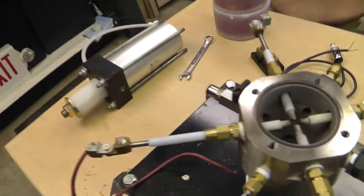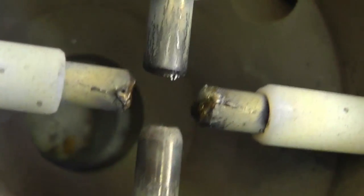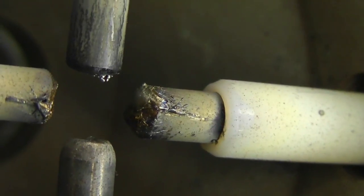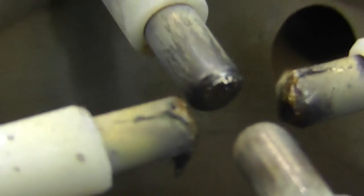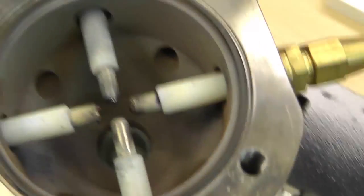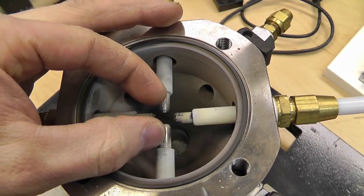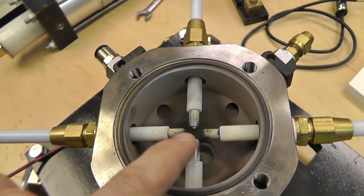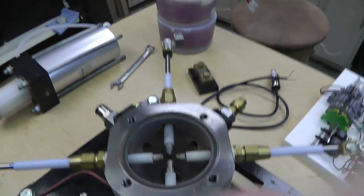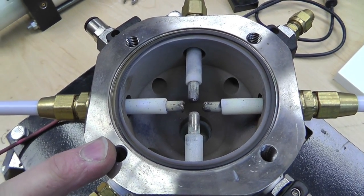The other type of circuit that I have hooked up, which is crossing the high voltage, let me show you what I found out. So this is real interesting. If you look closely, you'll see that I'm getting a giant mess on here and here, which are the titanium rods, the ones on the sides. The tungsten actually don't look real bad. That one looks kind of iffy. That one looks really, really good. So here's the problem. When you throw an arc across this way, whenever this discharges, it's like it's spread out, and I've never seen this, it actually throws material out at an angle, left and right. But it does it really, really bad. Not just a little, but every time it throws stuff really far. Not good. I'll do some demonstrations of that and show you what I mean.